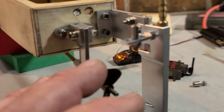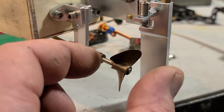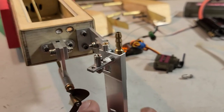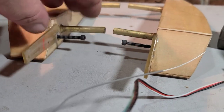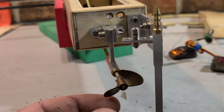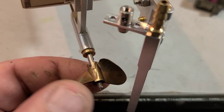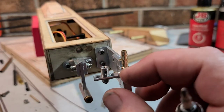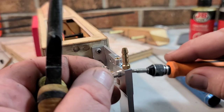That's one of the main things you need to look out for when building a boat and installing hardware on a custom build - make sure you're going to have enough room for big diameter props or pitchy props. A pitchy prop will actually have a longer hub so you have to take that into consideration. We're not going to be making a whole lot of left turns with this boat - with two turn fins we possibly will, but we won't need full left rudder. This is a 630 so it's kind of pitchy. I'm actually going to move my rudder bracket over to the other side - I think that'll give me more options for prop choice.